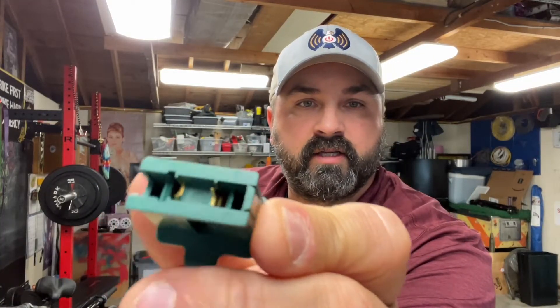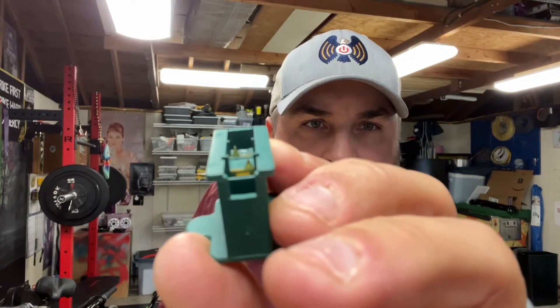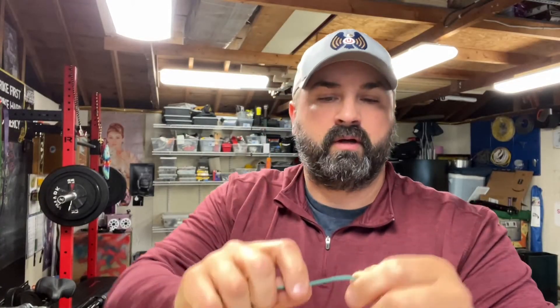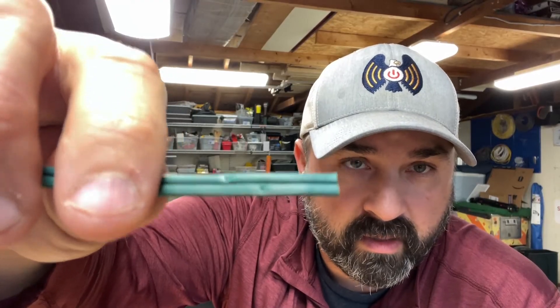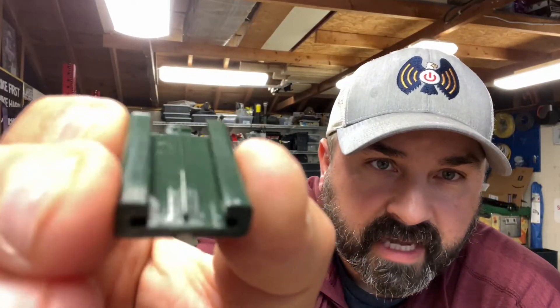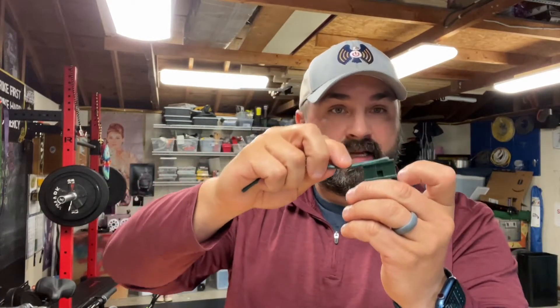Here's what's cool. When you put that in there — see those two little metal pieces — those actually go into the cable right there. The thermoplastic is a little bit smaller, but when it's in there it's a little bit wider, actually connecting to the wire. So when you have that in there and slide it in this little piece, because it's got that little angle to it — see how it's angled — sliding that in pushes that wire connector into those little prongs, which makes you a connector.